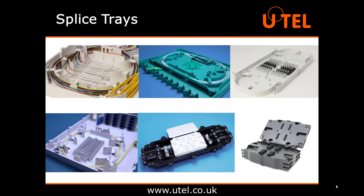In the real world, splices need to be kept in protective cases, conveniently called splice trays, which are then placed inside a splice closure. You can see some examples of splice trays here with their lids open or removed, including one known as the bomb in the centre of the bottom row. The splice tray protects the splices from moisture and ensures they are not being put under any unnecessary pressure or tension. Some patch panels have splice trays built into them to simplify storage.